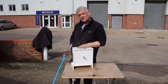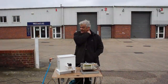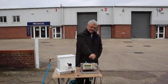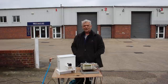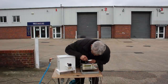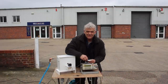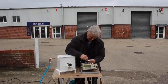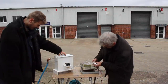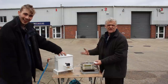We've got the generator, and if I'm very nice to Luke he'll turn on the water. Got the meter, got an LED light to light up — let's see what it does. Okay, so we're getting about 0.3 of an amp. Let's have a look at the volts — about 10 volts. So it's about 3 watts.